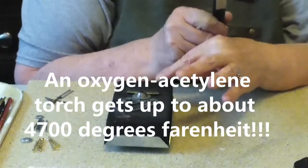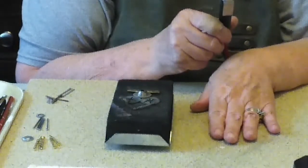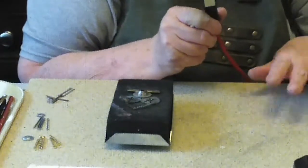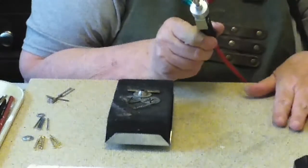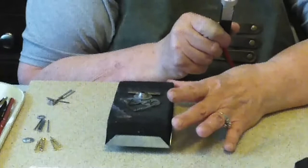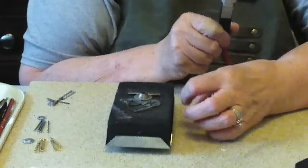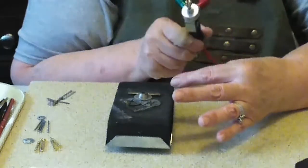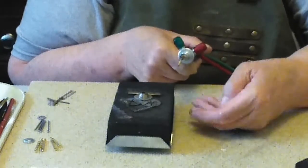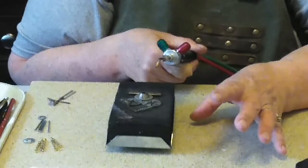I've got my soldering block, and I've got a flame-proof and fireproof brick under it. It's not really a brick, it's a board that I bought, but you can solder on it. It can withstand temperatures of several thousand degrees. The charcoal block, I use that because it reflects heat back up. It absorbs heat, reflects heat back up, so you get heat from the top, from your flame, from your torch, and from the bottom, so it warms up pieces and makes the soldering process easier.